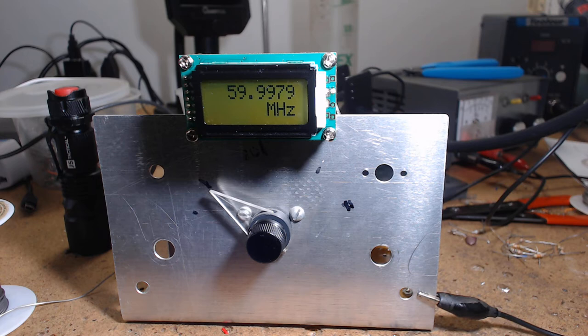I had an engineer at RCA, and as we were starting to get digital meters he made a statement: 'Just because it's digital, it doesn't mean it's accurate.' The other techs weren't buying it. If the last digit's bobbling, how much is it bobbling — a full three volts? We started getting the specs out and found that some early digital meters were meant so you could look quickly, turn a knob, and get it in the ballpark without straining your eyes on an analog meter with a mirror scale.